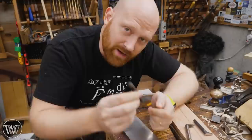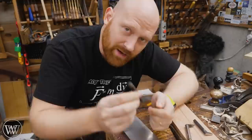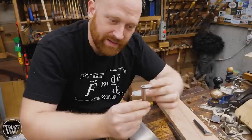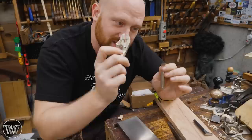The most common question is: how do you go about sharpening that thing? It's just a weird shape. Many of the new ones have a foot that can come off — there's a screw on the end you can loosen and take off — and that does make it a lot easier, but then you're trying to sharpen this tiny little piece. Usually at that point I'm going to use some vice grips as a sharpening guide and do it much like I would a spokeshave iron.